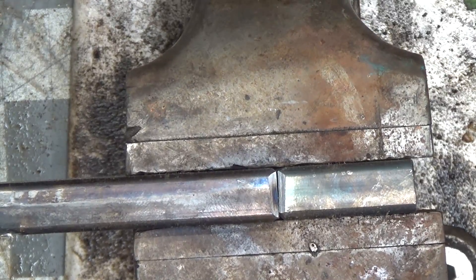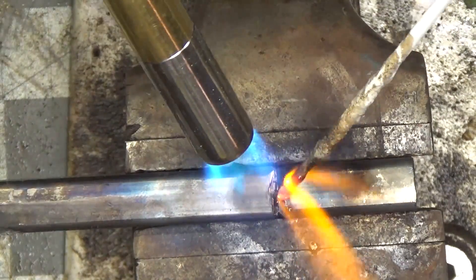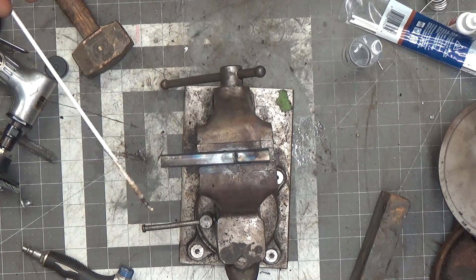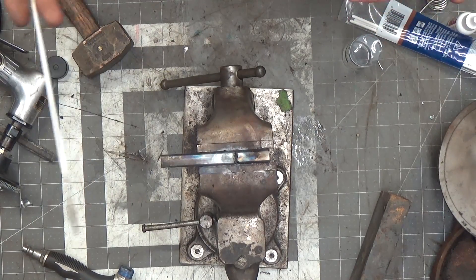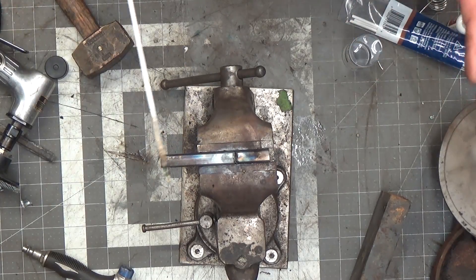For anybody who wants to leave a comment on how I suck at this — save your time. I'm not teaching you how, I'm just bringing it along. Alright, that is piping hot — but that is not working. I think the vise is pulling too much heat out of it. The lesson here is that in this particular case I don't have enough heat. The MAP gas, while it's hotter than propane, is not a solution for brazing small stuff — that's where the oxyacetylene comes in. I will eventually have that on the channel, but right now in an abundance of caution I don't use oxyacetylene very much, and it's not something you want to mess up with.